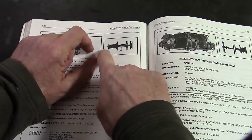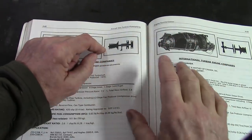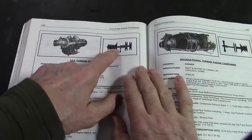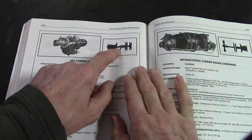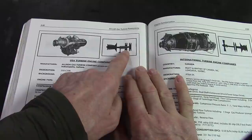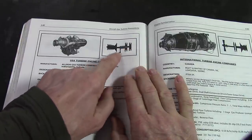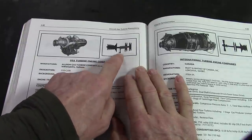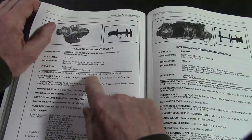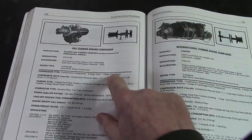Interestingly, the N-number is the order in which air encounters the rotating bits of the engine. So N1 is the compressor turbine — in a straight-through engine the N1 turbine would be up front, but here it's reversed. This is the high-pressure turbine or compressor turbine; that's the power turbine or low-pressure turbine. The order is reversed, which is really strange. This is a diagrammatic representation of how power gets out of the engine to the helicopter. Combination compressor: six-stage axial, one-stage centrifugal.